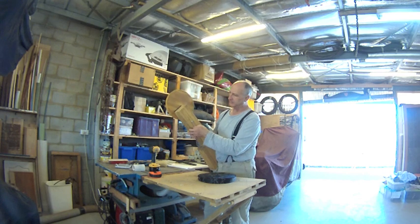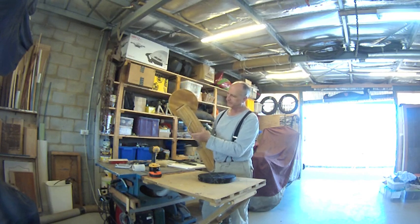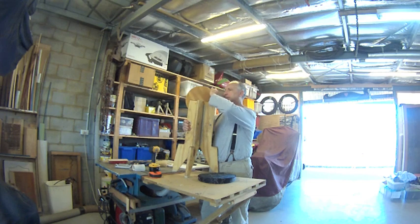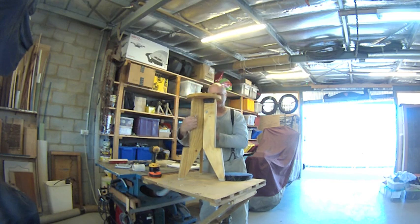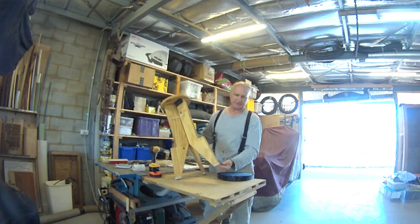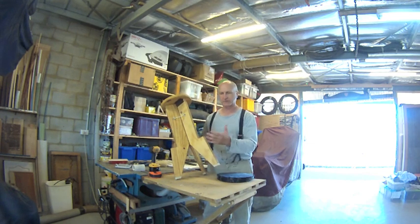The things in storage - I use this hook, with a little eyelet, that keeps it from flopping around. Piano hinges hold it together, and other magnets. Nice and solid on that dowel. This locks it open nice and solid, so it's really stable. I've used plastic feet because it's on dirt and whatever, and that means the plywood's not getting wet. It's not going to delaminate.